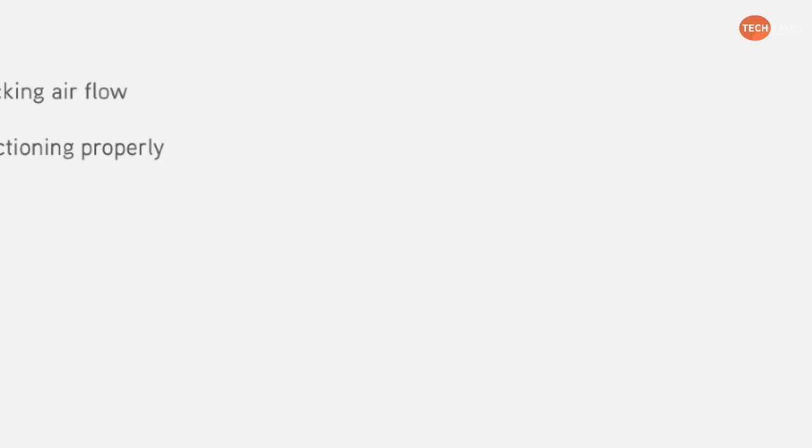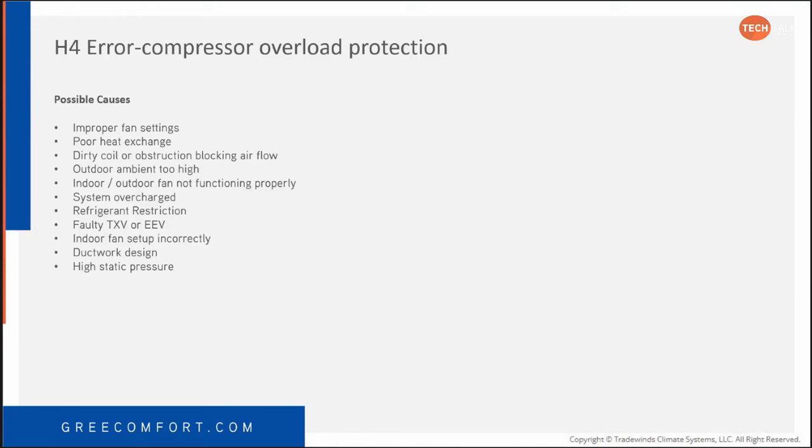Yep. Now, that's pretty much across the board on indoor boards. Anytime you're changing an indoor board, they're going to be moving a jumper cap. But there is select product, as I pointed out with MultiPro yesterday. Some of those boards have the jumper cap, and this machine definitely has that jumper cap. So kind of a word to the wise there.